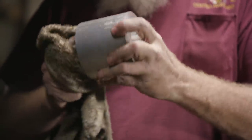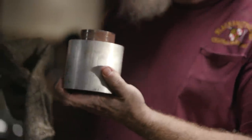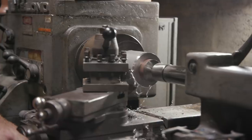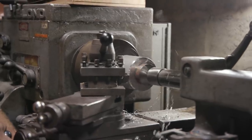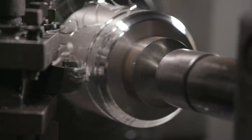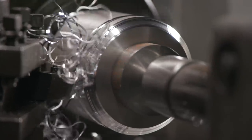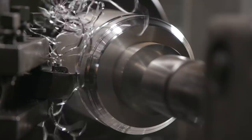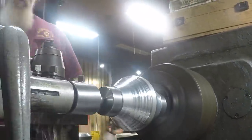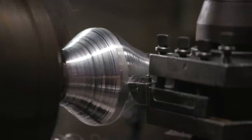I've bored a hole through the center of these large sections of aluminum, but I've made a couple of steel plugs. The reason for that is so that I can do what we call turning on centers, which allows us to be farther out from the chuck because the teeth on the chuck that hold material will be in my way if I try and cut both directions. By pushing it out farther forward, I'll be able to spin it on these center sections and that will let me cut the entire form in one set of passes instead of trying to figure out how to hold it and flip it over.